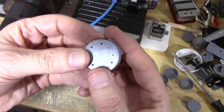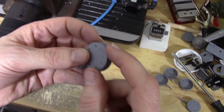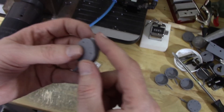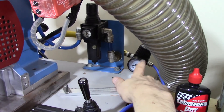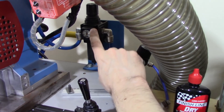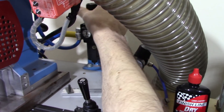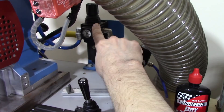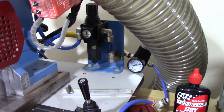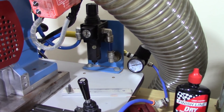There is a little bit of flash along here. What that means is I want to reduce the injection pressure a little bit or increase the clamping force, so I'm going to decrease the injection pressure. The clamping force back here is already at 110–120 psi, and the injection pressure is about 70. I'm going to drop it down a little bit — it doesn't really leak very quickly so this won't really show up until the next cycle, but I'll keep it on so you can see what happens.